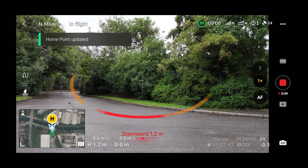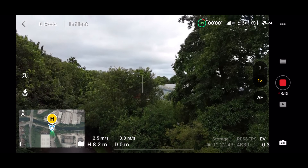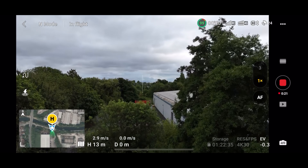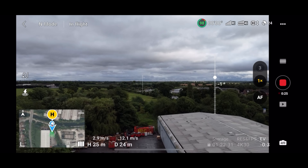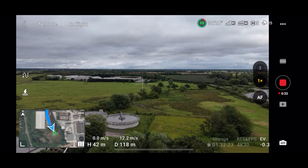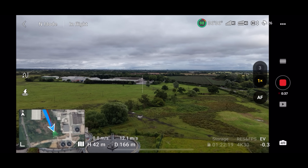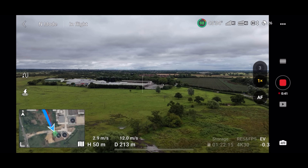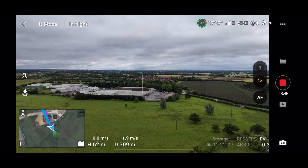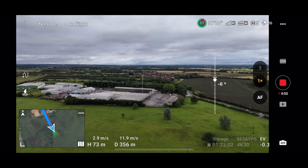Now for the big moment — a flight test with the DJI Cellular Dongle 2. I'm going to take off and fly in an area where the signal between the controller and the drone is going to be blocked by trees and vegetation. Trees are the worst for blocking signal. Ocusync 4 is fantastic but requires clear sight between the controller antennas and the drone, whereas the whole idea is that the 4G connection takes over when you lose that.